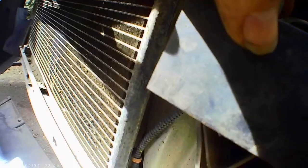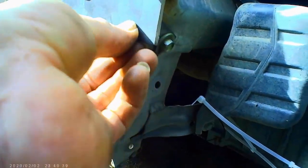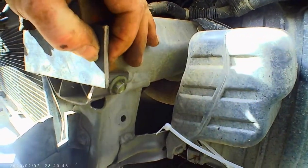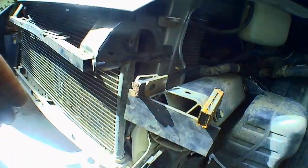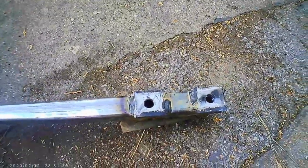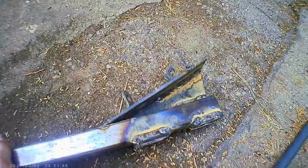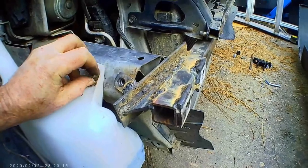It ends up being a little bit at an angle, so when I put the bar that crosses across, I needed to fill the space and I cut an angled piece, which you will see in a minute. I tack welded it once it was set relatively nicely, then unbolted it and welded it all together, and this is the finished product for my tow.